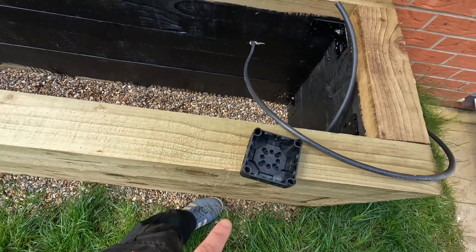We've now got the cable in position with enough slack — we just need to put a couple of fly leads and glands in. That amount of slack will reach over to the fuse connection unit, which will be the point of isolation, fused down to three amps. Now we'll work out where to put these two surface-mounted brick lights, get them mounted in place, and drill through for the cable entry.